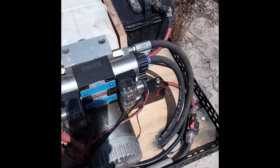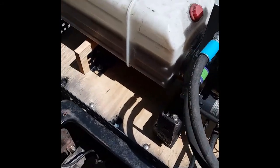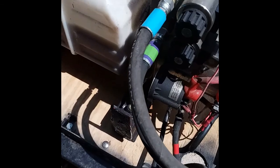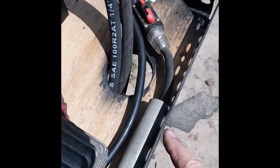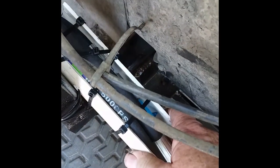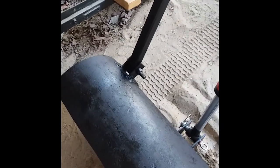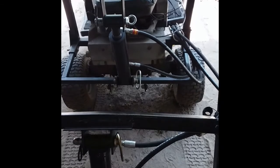There you can see the pump, the tank, the battery, the fluid in the tank, and the hoses. Take note of the hydraulic hoses — two operating one cylinder and another two operating another cylinder. Notice how they're routed: they go down and underneath, then run along the frame. I used some plastic PVC to make supports for those hydraulic hoses, and they work well for that. Four hoses total: two going to the upright lifting cylinder and two going to the pivot cylinder for the bucket. Notice that spring — it gives some flexibility to the hoses so that pressure on the hose attachment points is lessened.